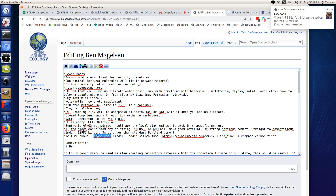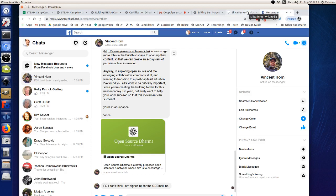You're looking at just a crucible. You could manufacture crucibles with this material and these binders, but you might need to go to something more technical on the ceramic side — like a silicon nitride, silicon carbide type filler, or a lot of graphite potentially. I haven't done that myself yet, but I'm near positive it can be done.